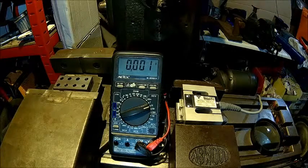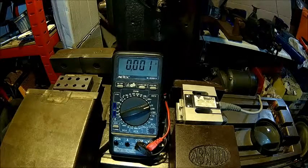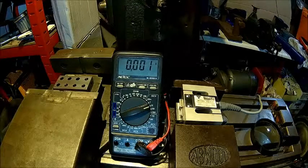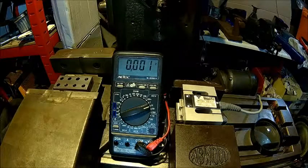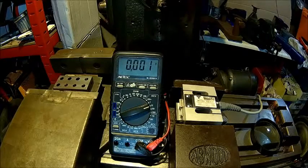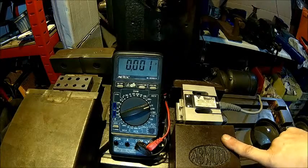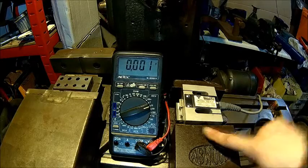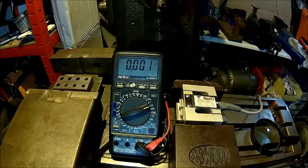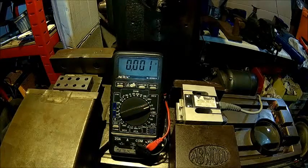Welcome back. Today we're back at the mill checking out devices. After some interesting discussion with Holzmichel and figuring out some calculations, I found my first attempt was wrong but the second appears to be right. Today we're going to verify that this small vise applies more pressure to the jaws than the big one with the same torque on the spindle, because this one has a 3mm lead screw and this one has a 4mm lead screw, so the ratio is different.